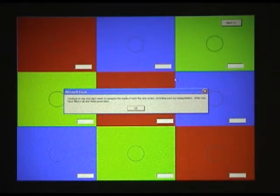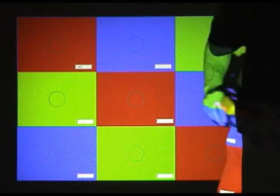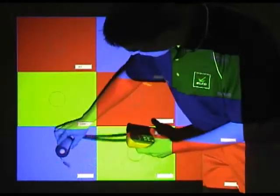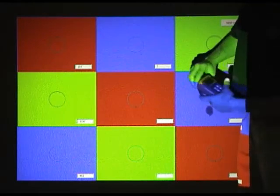This is actually enough to estimate the white brightness or lumens numbers, but we're not quite done yet. Next, we're going to measure the brightness of color — specifically red, green, and blue, the colors that make up the input signal. These measurements will give us the color light output for the projector. Why do we need to measure color? Well, the brightness of white is an important number, but it's only part of the story. When you project, you're probably not just showing black and white — you're probably projecting colorful photos, videos, websites, etc. Since we present in color, we need to measure color. The Excel tool will take you through three screens of color patterns — simply take and record the 27 light measurements and Excel will do all the work.